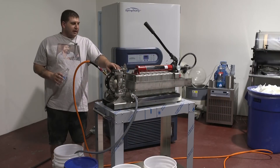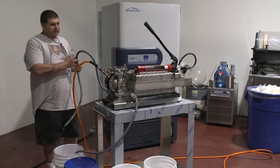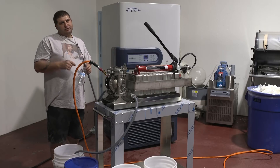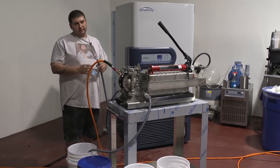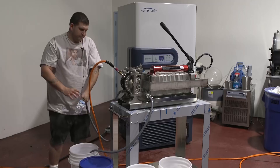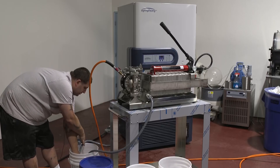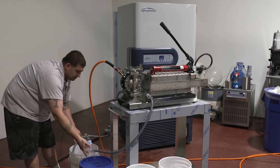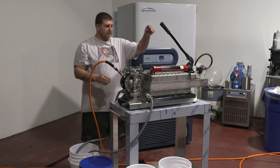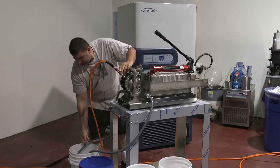Now that we're back we have everything set up. We have our feed material and everything's ready to go. We're going to try and prime the system — it's pretty easy. We're going to fill up this bottle and get it into the system. Next we're going to run the system to make sure there's no leaks using clean alcohol, which will be the same alcohol used to push the remainder of the product out with the cake. Pull it upside down — it'll start priming. Replace the hose. Now that we're primed we're going to shut it off, make sure there's no leaks and inspect everything. Bring it down to 4,000 PSI again and make sure that we're running leak free.